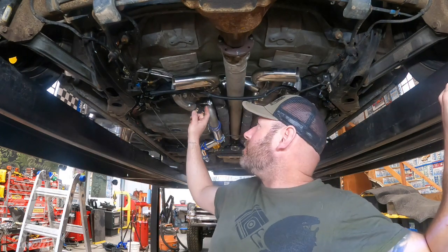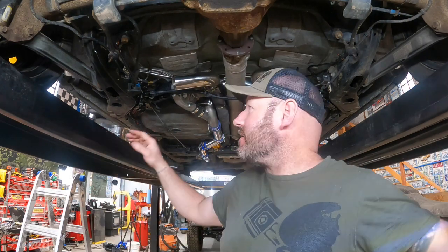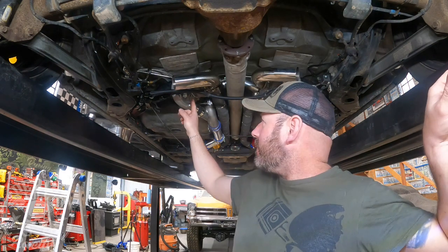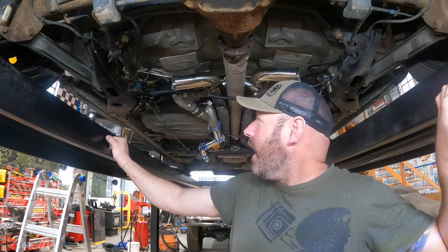I did share some misinformation in this episode and the last one about blowing the seals out of the turbo — that is not a thing. I just learned there are no seals in there. There's a ring that's kind of a seal — it's like a tension ring — and it's mainly to keep exhaust out of the oil, not necessarily the oil out of the exhaust. What keeps oil out of the exhaust is that it's just a small shaft and a small bushing down the center, with oil coming in the top and spraying out the bottom. There's really no way of it going out unless the center chamber were to fill up with oil to shaft level. That's the only way oil would really leak through there. So what I was saying about seals is incorrect — there are no seals there.